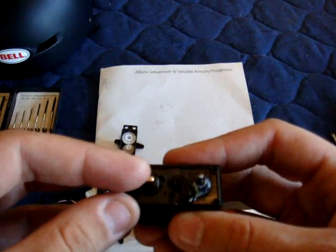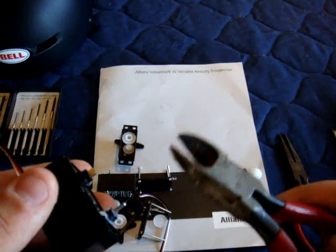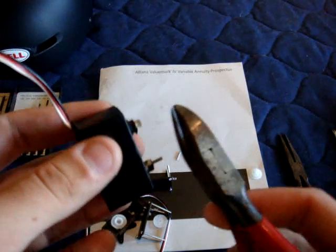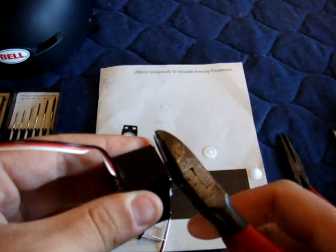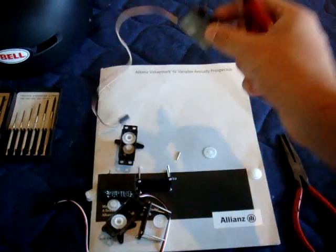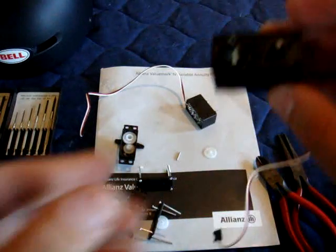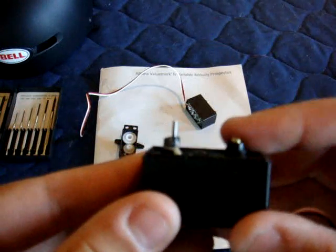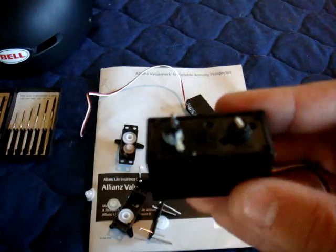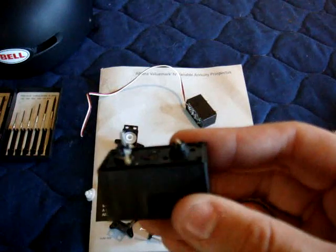What we're going to do is cut the top off the potentiometer. You take a pair of wire cutters — flat ones work too, whatever you've got. You clamp them down at the bottom as close to the inside as you can, make it easy on yourself, then squeeze it and let it pop off. It should be relatively flush. If not, what you usually get looks like this — it's not 100% yet but it's a lot smaller. To clean it up I like to use a Dremel to flatten it out so the gear doesn't catch on it.